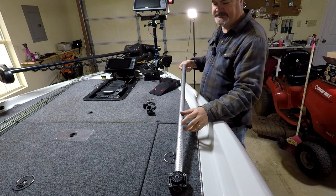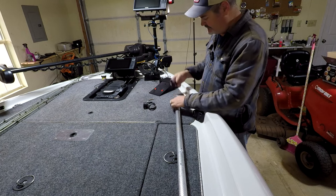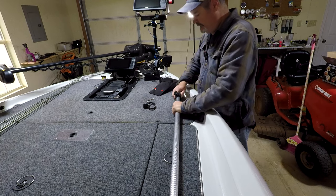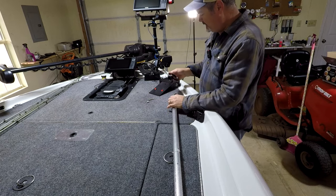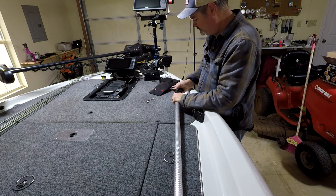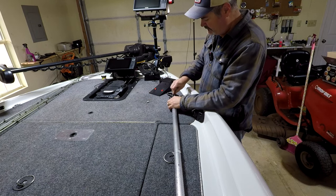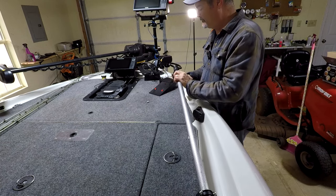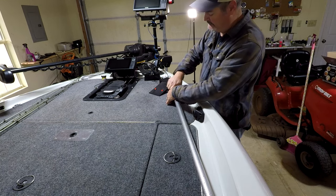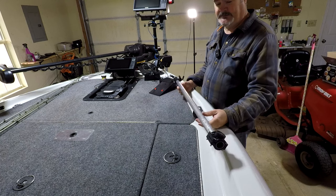The PVC sits right on top of the steering collar. Then the next piece is this steering collar — just push it up on there. Then the 3D printed handle goes on top of that, and you have a bolt that goes in and comes out the other side with a little nut on it. That bolt keeps the piece of PVC from coming out and holds everything in place. That's how it goes.